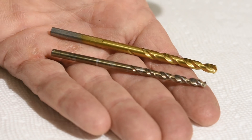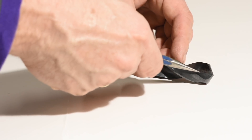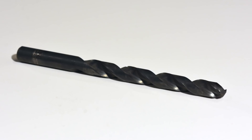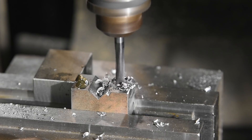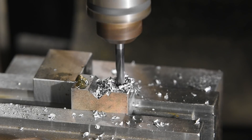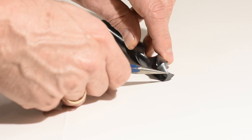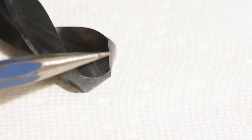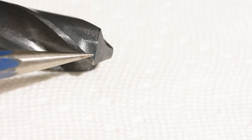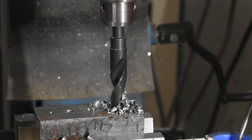Let's look at the geometry of the twist drill. This part is known as the shank. These are the flutes. The basic idea of the twist drill is that a helical flute is ground into the shaft. The flutes allow chips to exit from the cutting edge and work their way all the way out of the hole so that the bit doesn't bind up. If you didn't have flutes, the chips would pack into the hole, causing the drill to bind and very likely snap. The cutting edge is relieved, meaning that the edge slopes away from the material being cut. Too much relief and that edge is going to chip easily; not enough, and the backside will rub on your material, causing the tool to overheat and eventually fail.